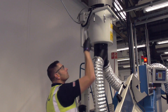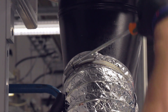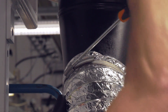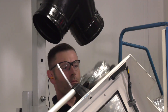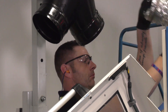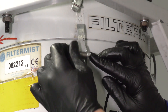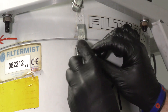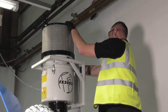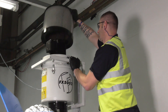Remove the oil return tube. If the unit is not directly mounted onto the machine tool, undo the jubilee clip on the ducting and remove the ducting. Remove safety bolts if applicable. If the installation includes an after filter, this will need removing from the unit.